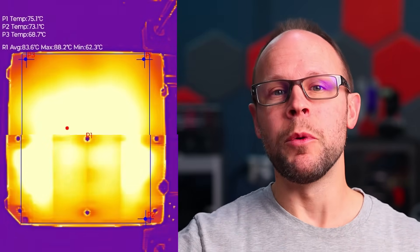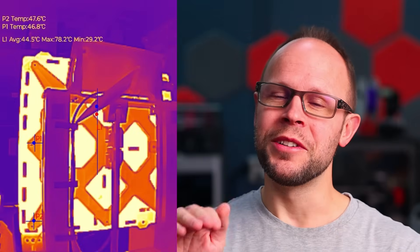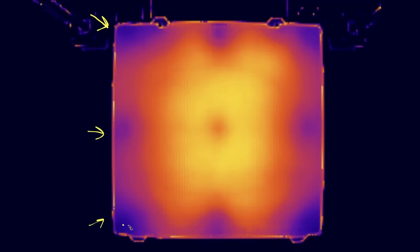I used my thermal camera and shot from the top on top of the build plate. I removed the build plate and shot on top looking at the elements themselves, looked from below, looked at the front on the standoffs, took the whole heat bed off and looked at the X-frame, and also the underside of the heat bed. One of the first and most obvious reasons is that the edges and corners are the most exposed, so they're probably going to be cooler — with corners likely being the worst.